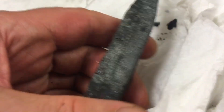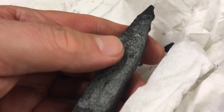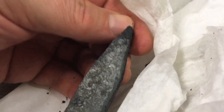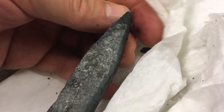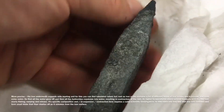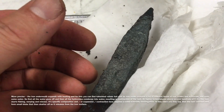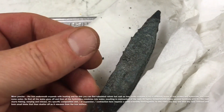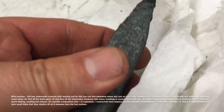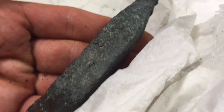So the suggestion from one of these YouTube watchers was pretty interesting. To remove rust, it flakes off a bit, but basically you just need to heat it enough and then cool it down. That can be tricky in some applications where you can't access this much heat. But the difference in expansion — since iron expands more when exposed to heat than the rust does — makes the rust crack and shatter off as pieces, and you get down to the bare iron without using acid or sandblasting or any other means of assistance.